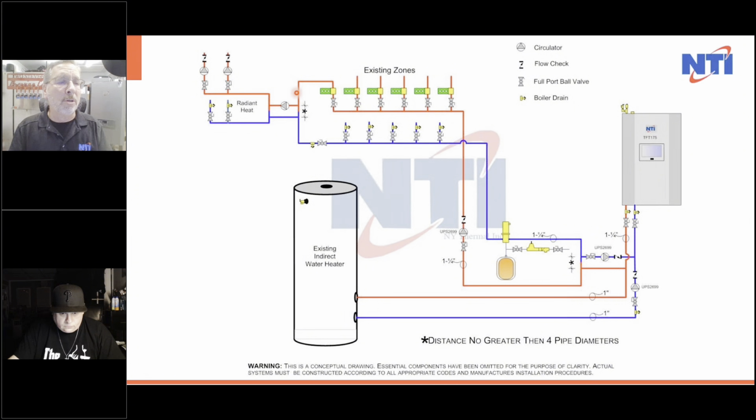On two closely spaced T's, because this pump is running, this zone valve opens and brings it around and mixes it so that the boiler's safe and the boiler's getting good even temperature so it can run nice. We're injecting the higher temperatures into the radiant heat, and everybody's satisfied. We've done this for years. These are drawings I made years ago that are working just perfectly fine.